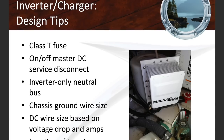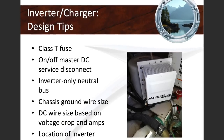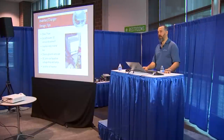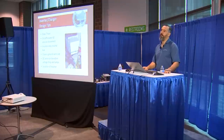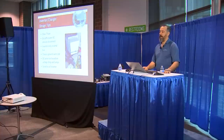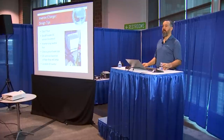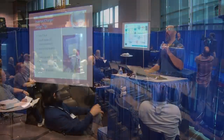Most inverters are done after the factory, and then it becomes 'get it done, make someone happy, do it in as little time as possible.' If you have an inverter on your boat, make sure all these items are present: a Class T fuse, a service disconnect, an inverter-only neutral bus, proper size ground chassis wire. The location of the inverter cannot be in a gasoline engine room, and the inverter cannot be 30 feet away from your batteries. When I find an inverter properly installed, I ask the owner if we can high-five. I see a properly installed inverter maybe once a year.